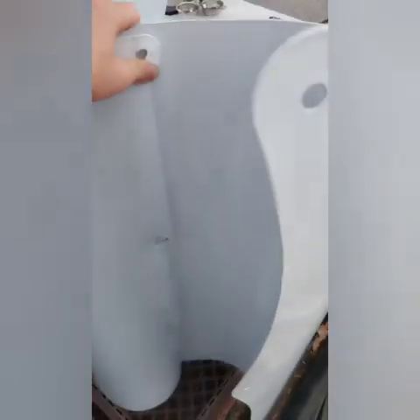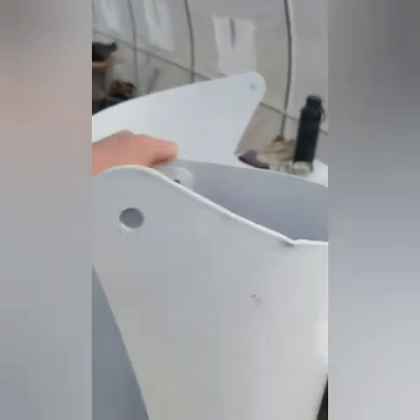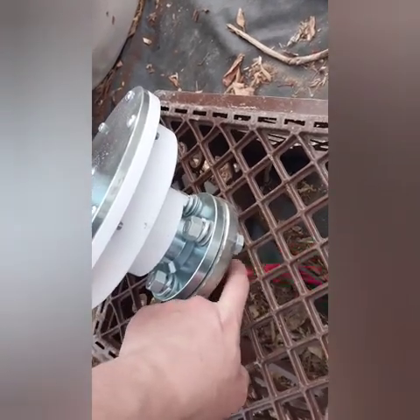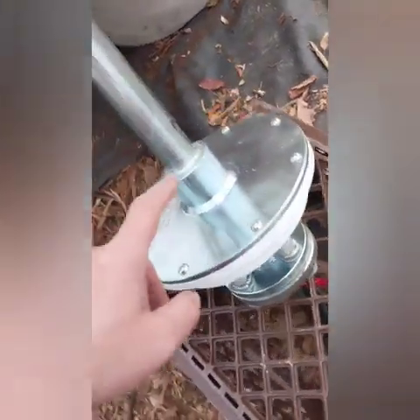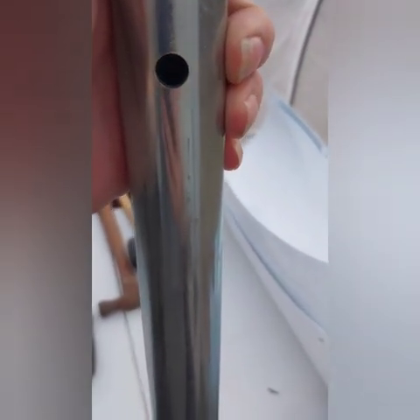Here's that orientation: the tab is going to go that way, so it looks like a big S. Remember that tab goes to the bottom, that tab goes to the bottom, and those sawtooths go to the inside. I'll show you how to start this and bend it into shape. You can choose to pre-bend it or bend it by the method I'm showing you. This was the best possible method I found: taking that base, putting the two flanges together, with the wires down here. If you're on a solid surface those wires aren't going to get marred up and cut while you're flexing and fighting with this thing.